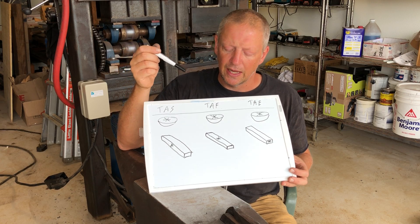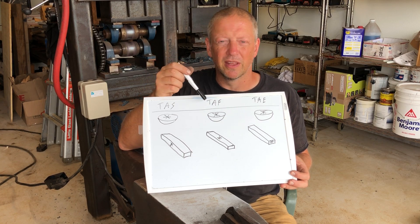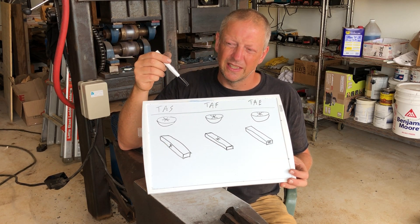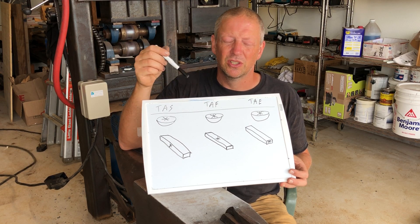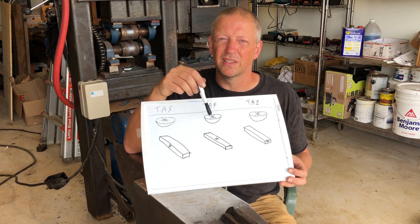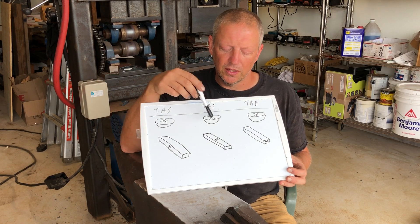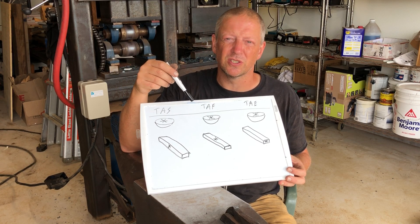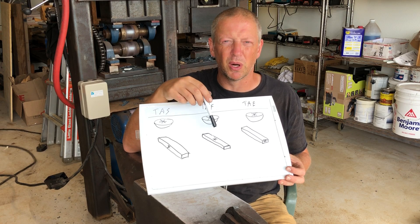You'll end up with a seam, but you'll also end up with that outer rim — the surface of the bowl so to speak — which is the best material, and that ends up as your cutting edge. So it's a great move if you're doing a single-edge blade. If you're doing a double-edged blade you don't have that luxury, and in that case most likely a large number of historical blades would have been forged out top as face. The disadvantage is you've got that crunchy material right on the face of your bar, so cracks are dead center.